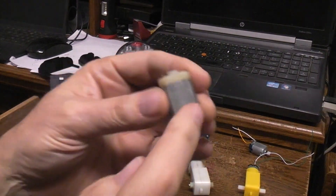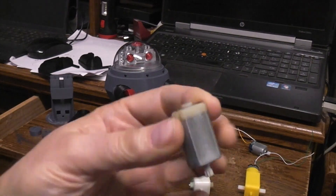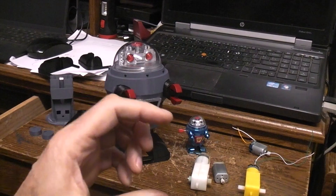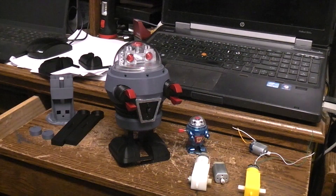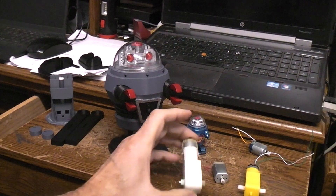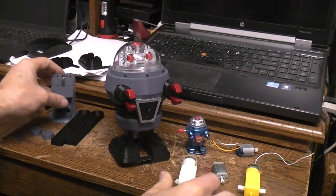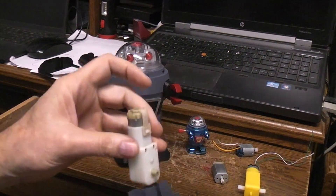This is a much better motor, but this motor doesn't even start running till you hit it with over five volts — it's preferred to run on six volts. So in order to get this one working, since I do have the blue TT motors with the metal gears on order, which is what I was hoping to use, but they haven't arrived, I took one of these and swapped out the motor — pulled out the long one, inserted a shorter one — and then because the dimensions of this box were slightly bigger, I printed a new frame that the motor goes into.